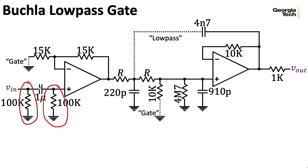If we were to assume that this op-amp was ideal, this overall circuit would have a 1K output impedance, which is a good choice for short-circuit protection on the output. As far as the input goes, if we ignore this cap, we see 100K and 100K in parallel, giving a 50K-ohm input impedance.